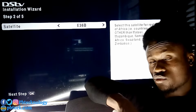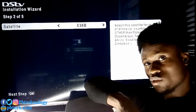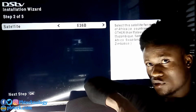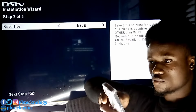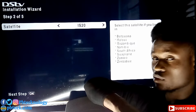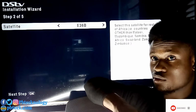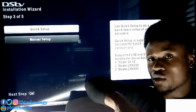Okay. So on your secondary decoder, the only thing you have to change is the user band index and the user band frequency to match your secondary decoder. So the satellite and other steps will be the same. With the satellite, you choose your satellite as we did for the primary decoder. If you are living in these listed countries, you select IS20. If you are not, you select E36B. You come down to manual setup.